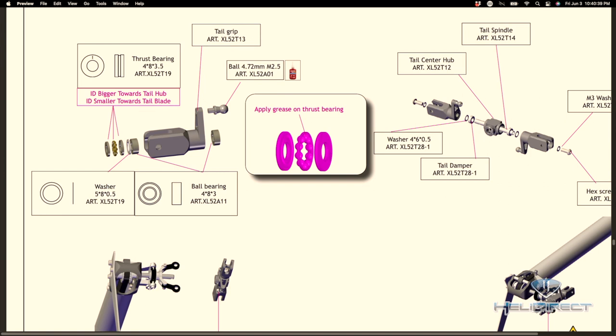We've got our tail rotor hub right here, and then we've got a couple of these hard plastic palm dampeners that'll go in the head, and then we've got a washer here, as well as an optional shim not shown here. If we get a little play in the tail rotor, we can go ahead and add those. And then we've got our two blade grip arms. And then those will be followed by a bolt and washer into the end of our feathering shaft. That's this metal shaft that runs through the whole thing.